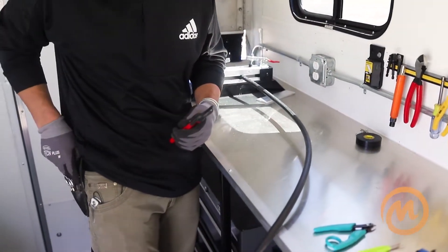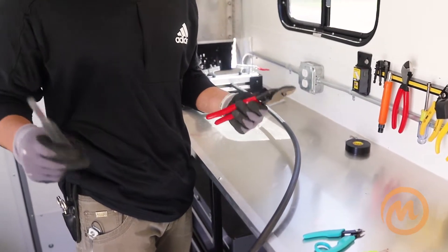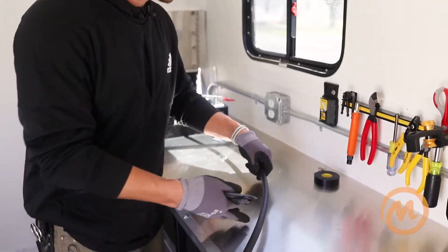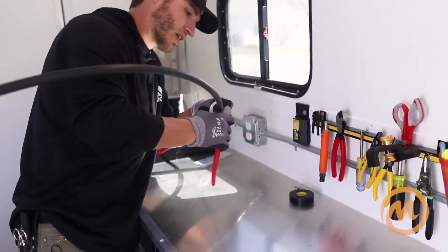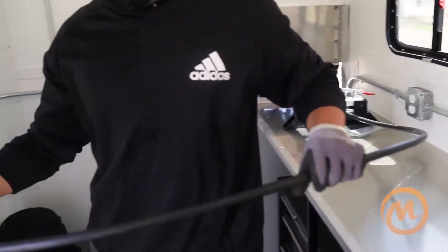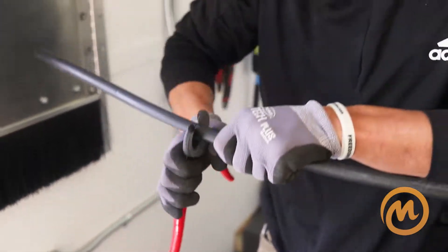You can either use your knife or your cable cutters — I use cable cutters, but it's based on feel, so you choose what you want to do. If you're an experienced fiber tech, cable cutters are obviously faster. We start here at the base and you'll feel it when you get to that first sheath. I made my cut there, then come down to the end, give it about a foot, and do the same thing.